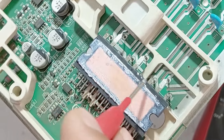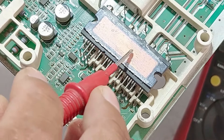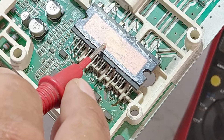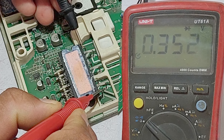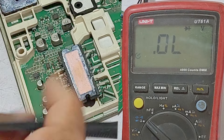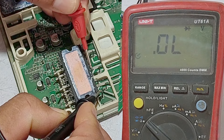The position of the pins in this IPM are different, but the testing will be the same. The ICs are installed in pairs on the low side of this IPM — this is the first complete pair, this is the second pair, and this is the third pair. I will attach the multimeter's positive pin to the positive and negative pin to the negative on the IPM to test it. It is showing some value, but this value will finish — this pin is absolutely fine. Let's move forward to the next components.